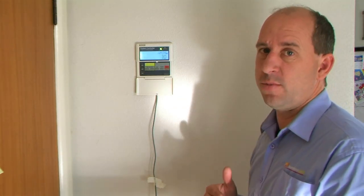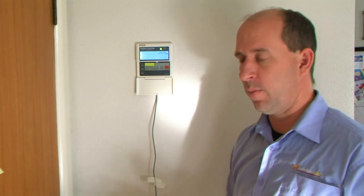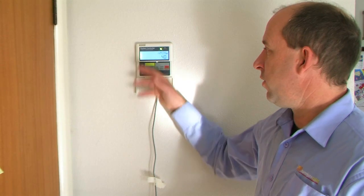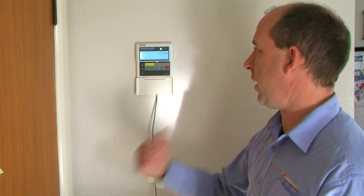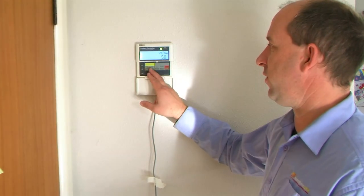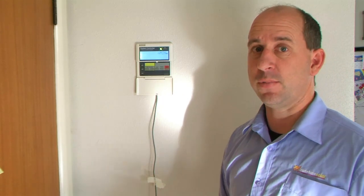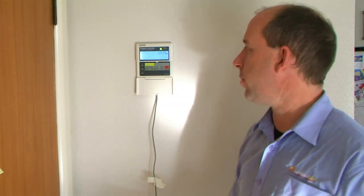Nmin is the speed controller of the pump — we can control the pump to run faster or slower depending on how much solar energy is available. When the temperature on the roof gets 12 degrees hotter than the bottom of the cylinder we'll run at 30% speed of that pump. This is the minimum speed, but for every degree above that 12 degrees the pump will pick up speed so that the solar energy won't take off with intense sun. Normally it's set at 30%. To get this running effectively you need your pump running on speed number three.